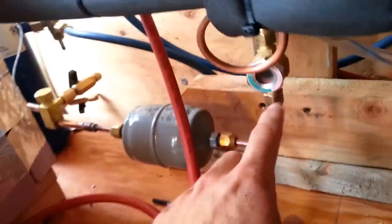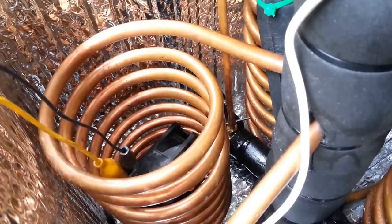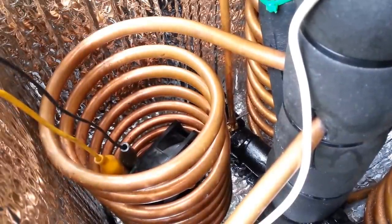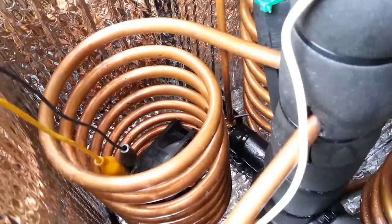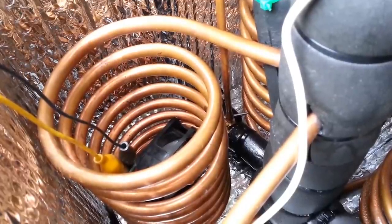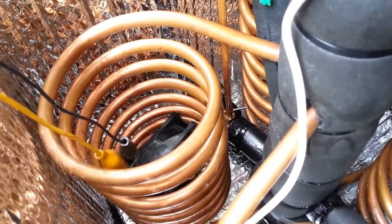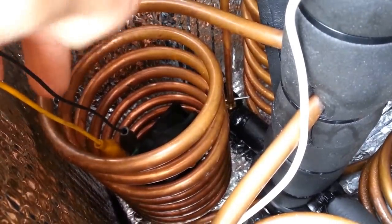So high-pressure hot vapor goes in, and a slightly lower-temperature liquid comes out. You can actually see it in the sight glass once I get it fired up. Disregarding the filter and some valving, there's a tank over there — it just makes things a little more convenient. The liquid flows into this line and heads towards the evaporator. Before it gets there, it has to go through the little valve. Remember, it's about 150 psi. What this valve does is restrict the flow of that liquid refrigerant. I can change how far open or closed it is by controlling it there.